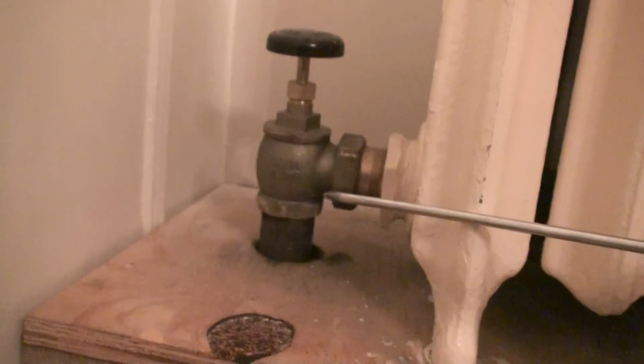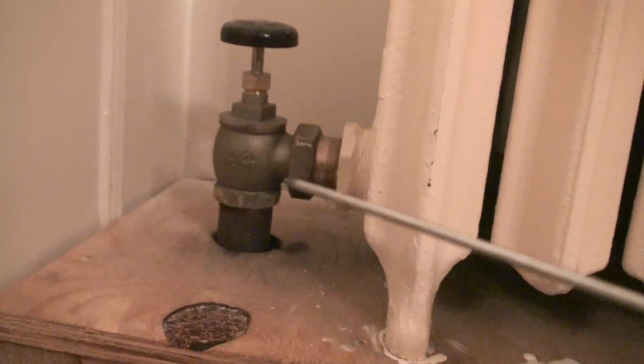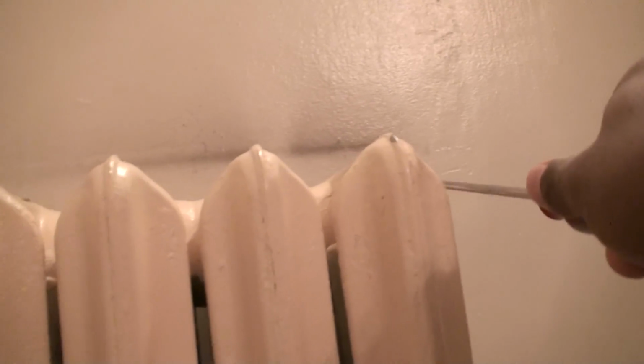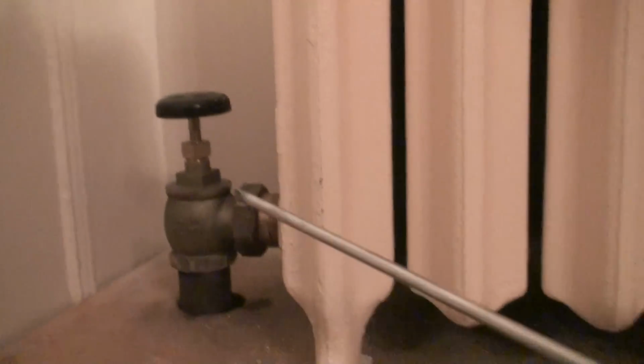The most effective way to do a hot water system, and I see people do some real bad connections, and what they'll pretty much do is they'll run their feed from the bottom and then they'll have it escape through the top on one end or end to end. Very bad connection. Once again, you're doing a diagonal effect. So you're not getting the heat all the way over here where it needs to go, because heat's going to rise at the easiest point. And normally when you're first coming in, especially if that's a very long radiator, you're going to have a hard time heating it up. Now, if it's not that long, you might not have that much of a problem and you still might get the same heat. But you will have a better chance of getting much better heat if you run it like this.